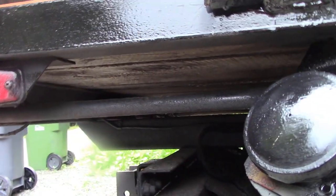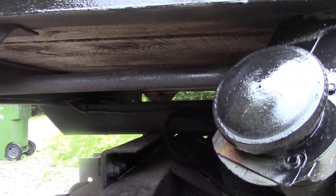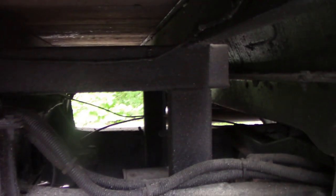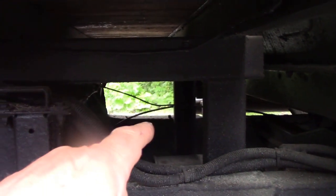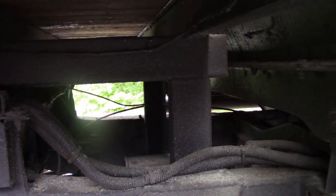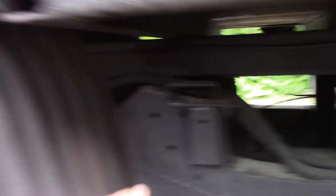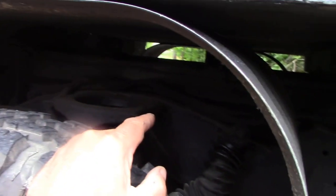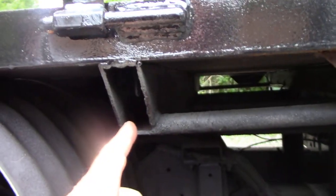Have a look at this little area first to see how I did it, then we'll look at the front because I did something completely bonkers. What I did was I welded two tubes either side onto the inside of the frame to pick up the longitudinal pieces. I didn't pick up off the cross-member but put a support on there, and then added my supports going here.